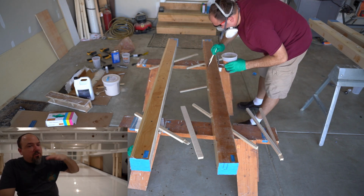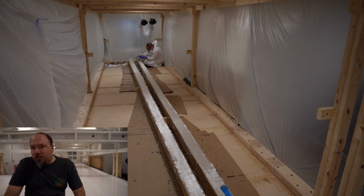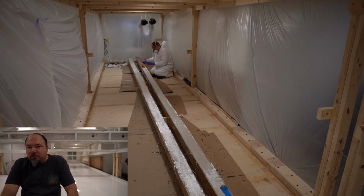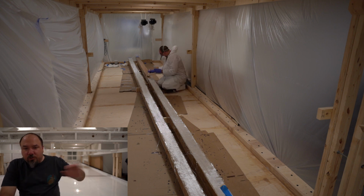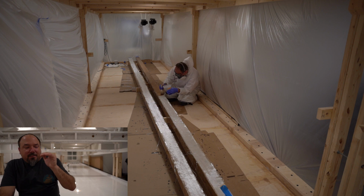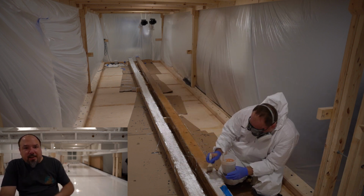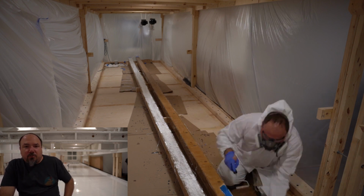So I would then go ahead and apply the woven cloth fiberglass. I found with the woven cloth I was using, it was much better to just put the cloth down where you needed it and then just soak it through with resin, as it was more difficult to try and wet everything out and apply it while it was on a wet surface.